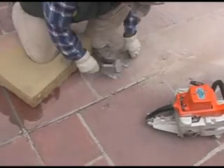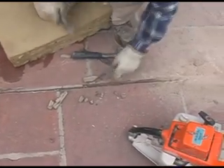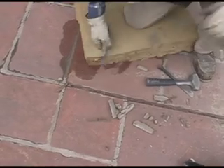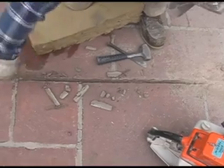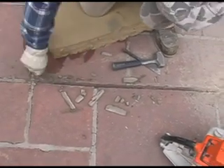You just cut right through the two sides of it, then come in with this longer sharp chisel and it just kind of pops right out. Guide along the stone on both sides and as you can see, the old cement comes out rather easily. Once it's all popped out, sweep it out, then fill it in like we did earlier on the tape — sponge it and it's done. Then you clean it with 600 detergent like we did earlier so they can always maintain it.